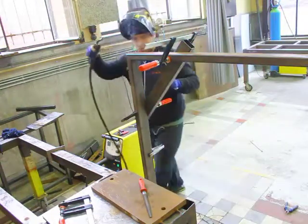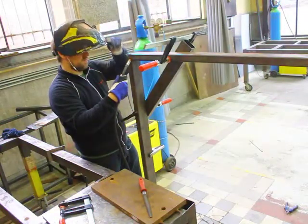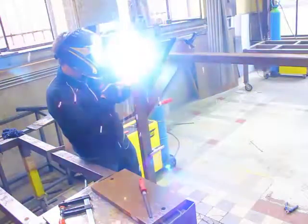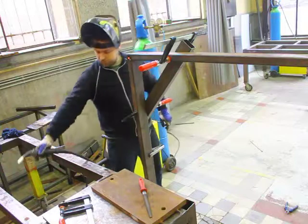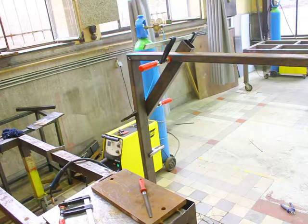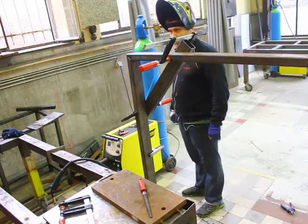To be completely honest, for 99% of the time that's more than enough. Most parts that fit together — it's very unlikely that somebody building a bench is going to need accuracy in the thousandths range. Of course you can do it but you have to get a granite plate or a big flat surface to weld the frame on. As you can see, I'm not welding on a flat plate because there was none large enough or square enough — the work benches here I measured with a 1 meter straight edge and they were so crooked that welding almost floating as I am is going to produce the same results.